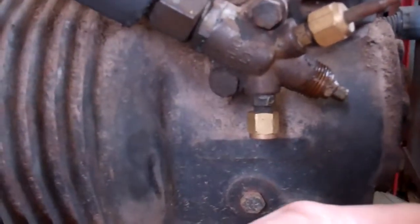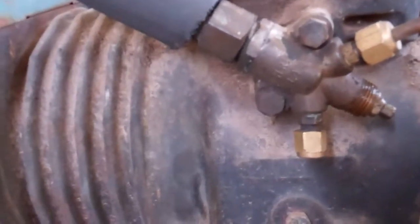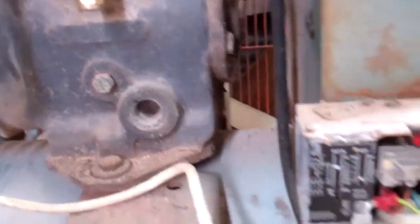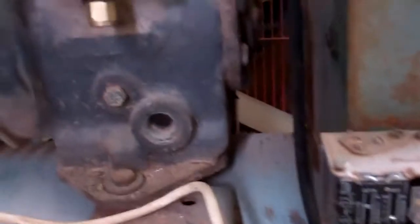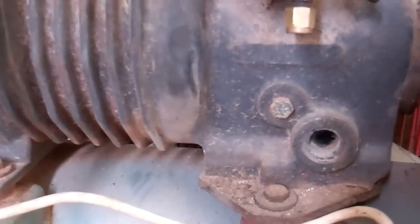If I wind that valve over and shut that cap off, it'll let all the gas into the pipework - it's already full of air when it was installed - so we're going to give it a quick buzz. It should go off on a low pressure switch to suck any vapour out of here. Let's see if it works.